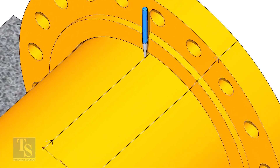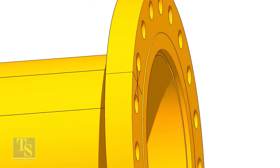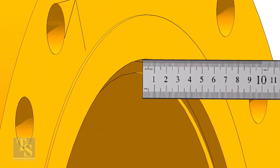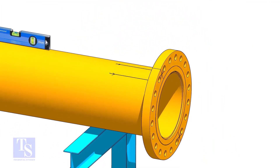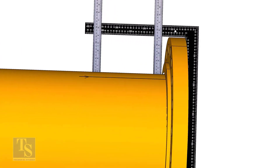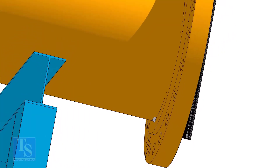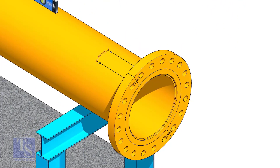Don't forget to punch mark the center lines. Fix the distance between the flange face and the pipe face — usually this measurement is equal to the thickness of the pipe. Tack weld on the top of the pipe with the flange and check the squareness. If correct, tack weld at the bottom side also. Now maintain the squareness of the opposite side and tack weld on both sides.